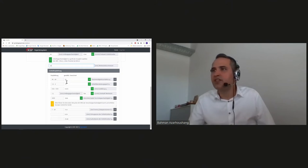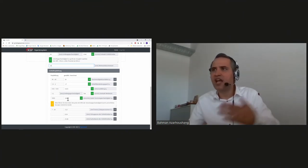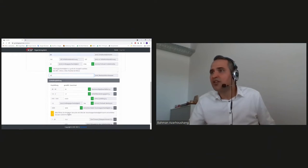And you see here with CBN, we can achieve really high material removal rates. We can also realize really high axial feed speeds. Just look at this. We have 13.5 cubic millimeter per millimeter per second specific material removal rates. The process is roughing.